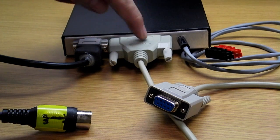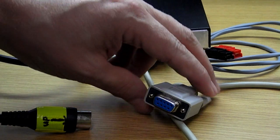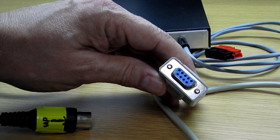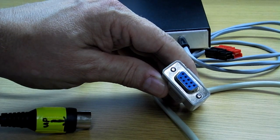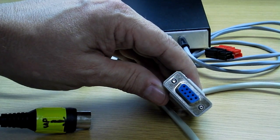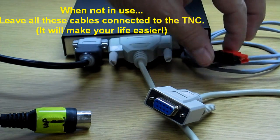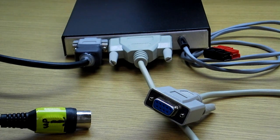The next connector at the box is a 25-pin cable connector, but what comes out the other end is a standard 9-pin sub-D serial connection. This connects to the back of your computer if you have a COM port; if not, you'll use a USB interface to accomplish that. The last connection is a power connection with Anderson PowerPole connectors. So these are the three cables you'll connect to make the KPC 3 Plus operate.